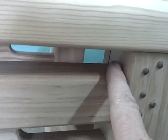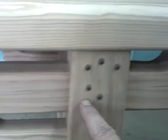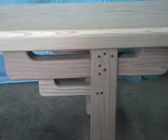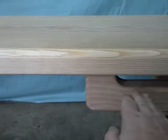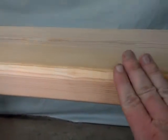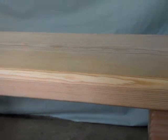This piece has been cut to fit into a cavity I cut in between the leg, and then I replace a block back over it after it's been pulled down from the top. So this piece is very sturdy — it's glued in place and pegged in place, and it's literally one piece going all the way through. The mechanics of this design allow the bench to handle shear force and rocking, which eliminates the need for a full rail going across. Since the bench top is very thick, it will support the weight without needing something else across it.